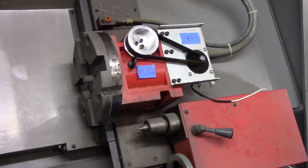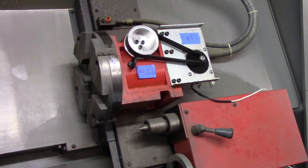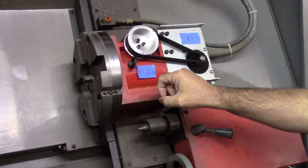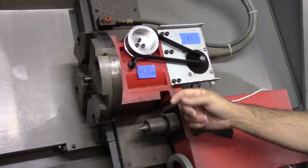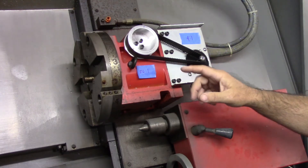Okay, here we go. So it's a unidirectional turret. The tool plate has pockets and ramps, and there's a pawl that the turret rests against that takes the tool pressure. That's why it advances a little further and then comes back to rest on that pawl.